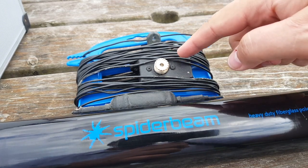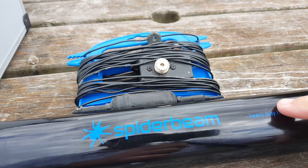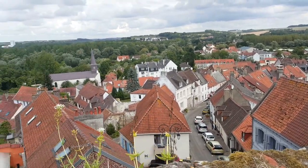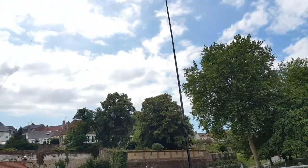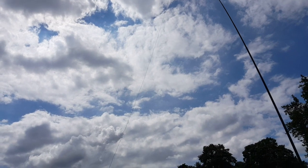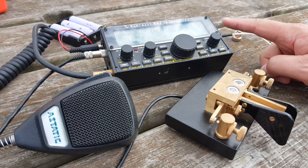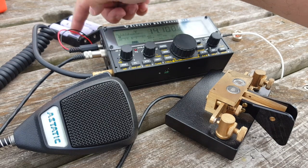This is a great antenna — I once had a contact from Florida to Estonia, 5,200 miles, using only 1.3 watts, so I know it works. Now I'm going to set up the Spider Beam and we'll get going. We have a pretty nice view of the town and the countryside, and I put the Spider Beam on the fence. The PAR antenna — now sold by LNR Precision — is set up at a slight angle. The KX-2 is plugged directly into the antenna with no tuner needed, along with my Ken key, a microphone, and three 18650 cells for power.